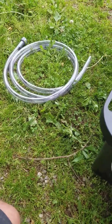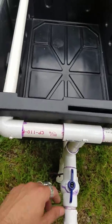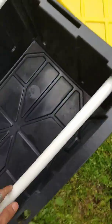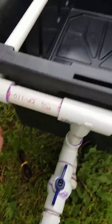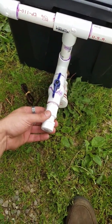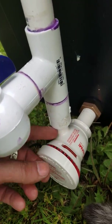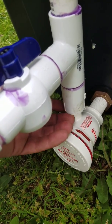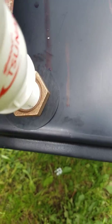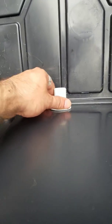You will need 10 feet of straight line, two end caps, two elbows, two Ts, a valve, an external threaded glue-on adapter, and a threaded glue-on adapter for your pump down here. If you choose to use the Tsunami pump, you'll need that adapter because it has threads. I also grabbed a nice thick rubber washer and a brass nut.